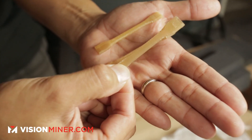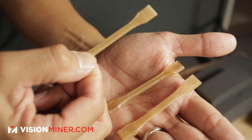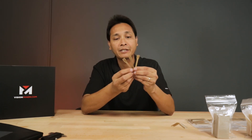They gave us a couple files and asked us to print in different orientations. For example, like this one here was printed this way. This here was printed this way and this is printing up. The reason they have us print in different orientations is because they want to test the strength of the X, Y, and Z on this print.